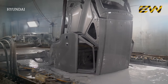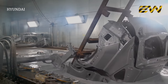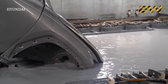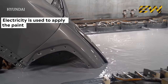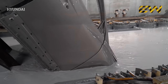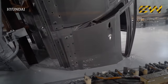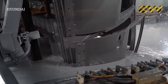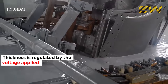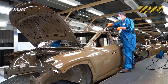E-coat, or electrocoating, is a process in which electricity is used to apply the paint coat on the body, very similar to electroplating. An electrical charge is applied to the paint while the car's shell is grounded. The paint is thus attracted towards the shell while it's dipped into the bath. This process is continued until the desired thickness is reached, regulated by the voltage applied — higher the voltage, thicker the paint film will build on the body. This is a very crucial paint coat, as it prevents the body from corrosion.